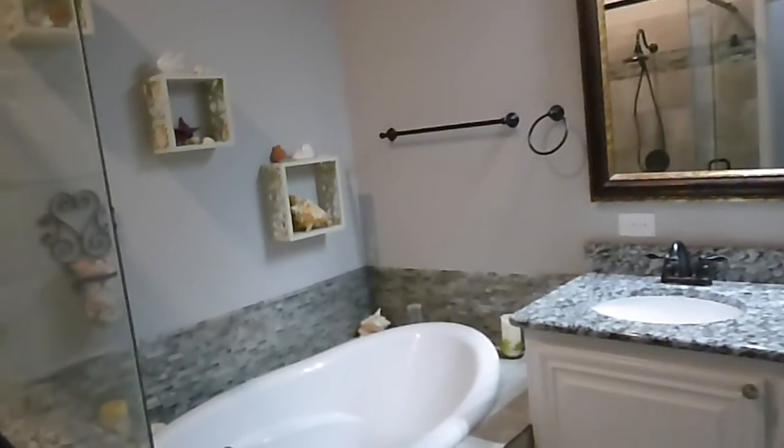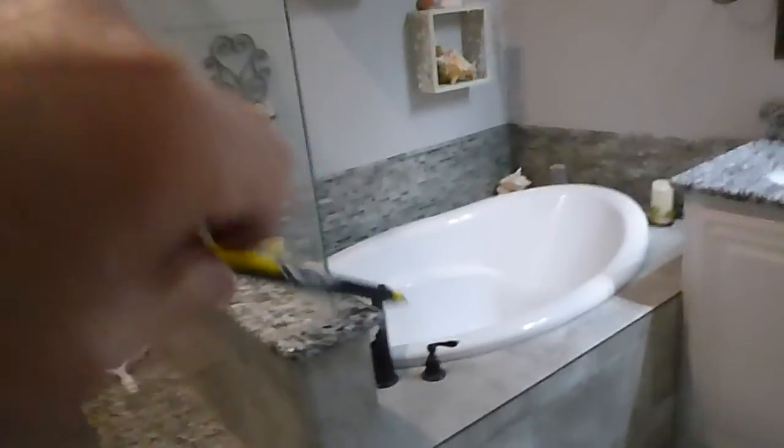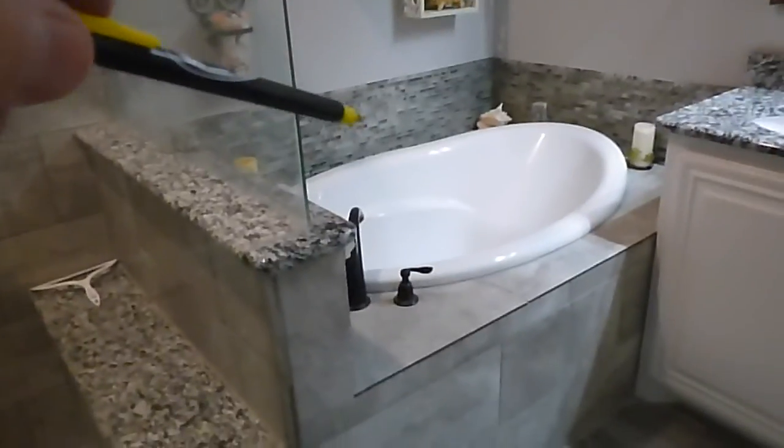In new construction I would have called that out. Back to ceiling fans in wrong locations — just like on a jacuzzi outside, this fan is not supposed to be within eight feet of the bathtub. I know you're probably not going to throw a wet towel up there, but it's not supposed to be there.